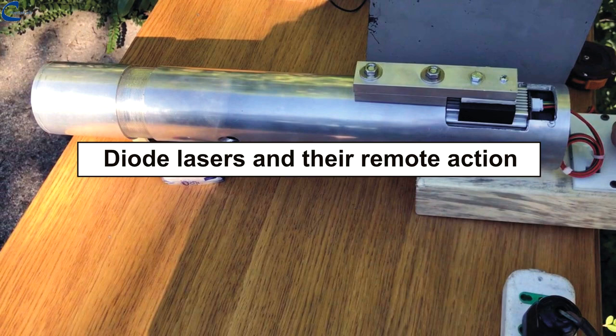In the same way, by enlarging the diameter of the output beam, we will have less divergence. So to make a long distance pointer, tens of kilometers, it is essential to increase the diameter of the beam at the start, that is, use a collimator.